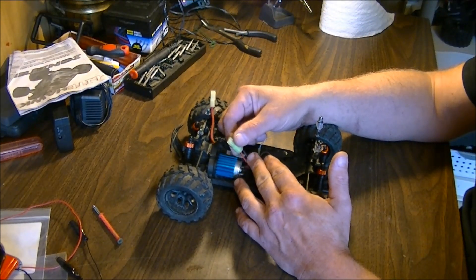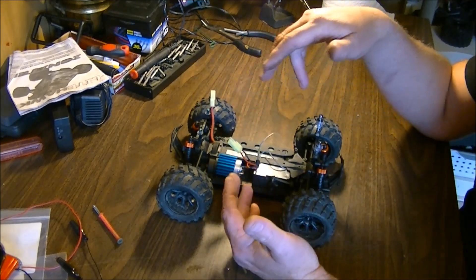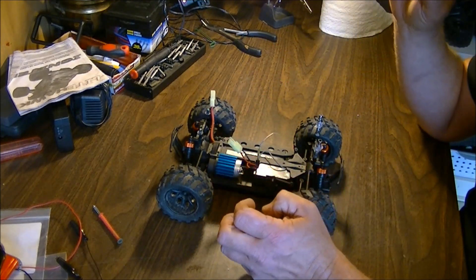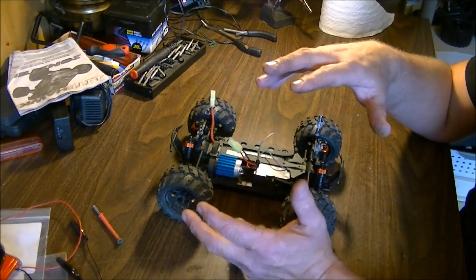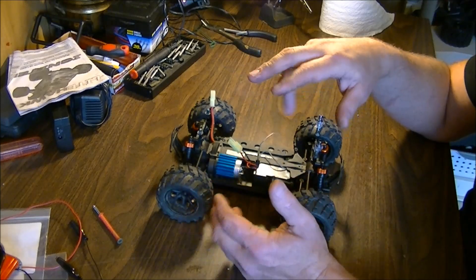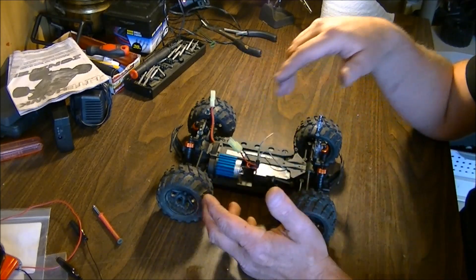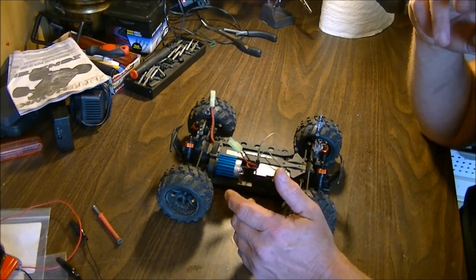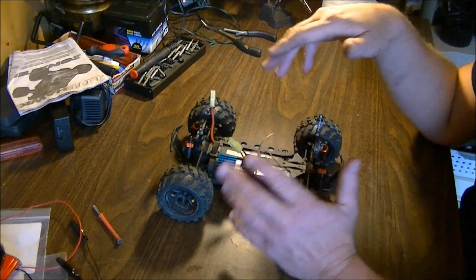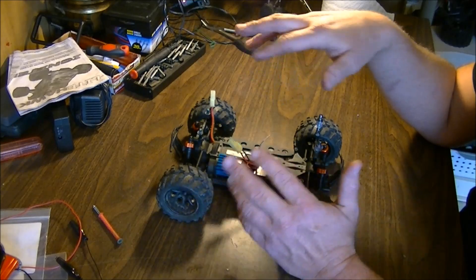You've got positive and negative. You also have to decide if you want the air to blow onto the heatsink to cool it, or if you want it to suck the hot air away to help cool it. That's going to depend on which way you wire your wires up, because the fan will travel in both directions — forward or reverse.